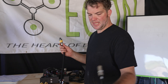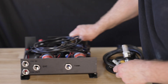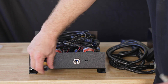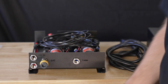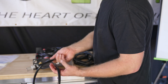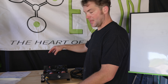The last hose in the kit is the external pickup. There's a little mesh filter on here, with the same fitting as well. On the back of the water hub, the tank and the EXT are the two different inputs the unit has — EXT means external pickup. You put a bit of plumber's tape around this fitting, screw it in, and now if you find some drink water, have canisters or a bucket, all you need to do is plug the external pickup in and drop this hose into your canister or bucket. You then turn the switch on for the external pump, which has the green background illumination, and you start sucking water through. You won't get any water out of your tap outlet because this is considered contaminated water, and the one-way valve will protect your tap and drink water circuit from being contaminated.